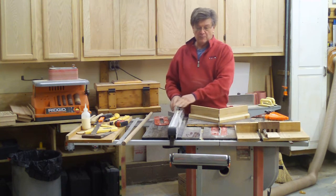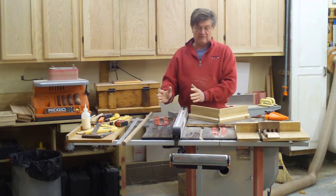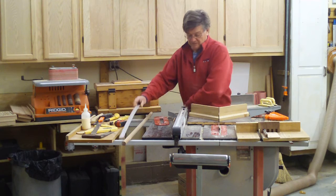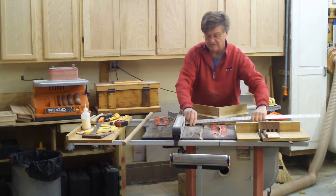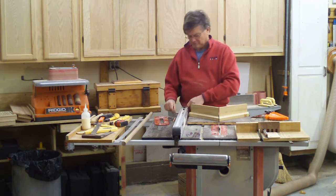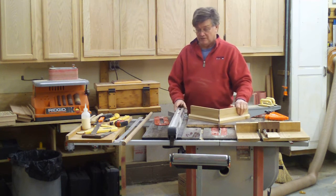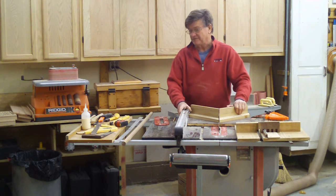The fence — you can upgrade and get a better fence. What I have to do with this fence is it keeps getting out of alignment and you won't be cutting square. Every now and then you've got to set it up, tighten it down, and measure over to one of the grooves in the table and readjust your fence. About once a month I have to turn the screws and readjust it. They make higher-end fences and you can spend as much money as you want on one. I'd like to have a better fence, but it just comes down to money.